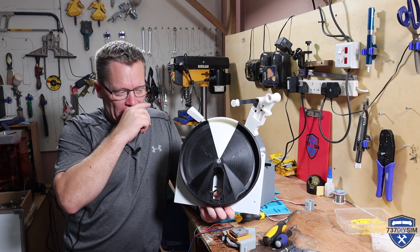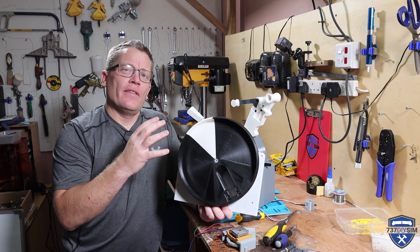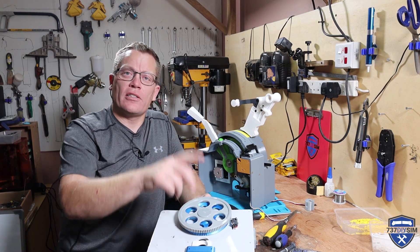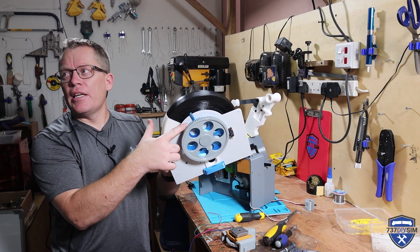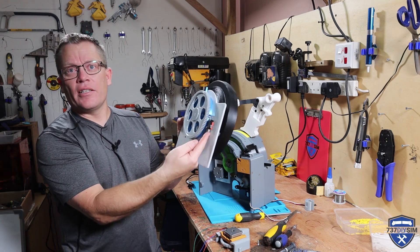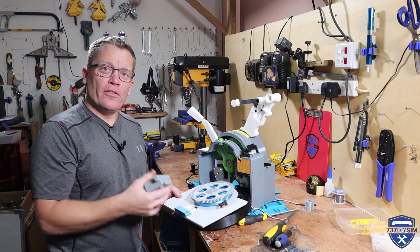What I've got here is the left-hand end cap. This has the trim wheels — these are full size. They've got big bearings in the end cap here, but they are very heavy and lopsided because of the extra PLA mass. That isn't going to be an issue because it will be balanced by the other wheel, being 180 degrees apart. It's driven by this gear at the back, and there'll be a drive gear and pinion that comes right across from this side to the other side, so they are combined. Hidden behind the drive gear, in blue, is the trim indicator. You can hear the micro switch activate — that's the home switch, or zero point switch for the stepper, so every time we power it on it knows where it is. There's a little ramp in the wheel; as the stepper motor reaches the zero point the micro switch breaks.